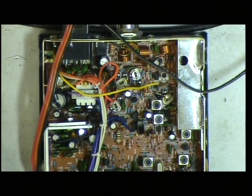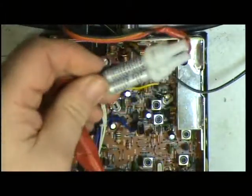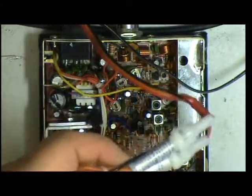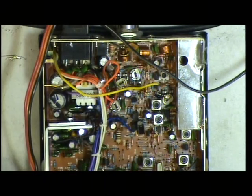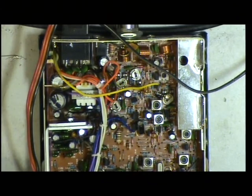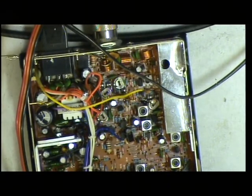The circuit diagram we've got is a photocopy of a photocopy; the block diagrams are some help, and I've been able to do up a little chart of adjustments. So we switch it on — these default to channel 9. They have a 3-wire power lead: two positives and a negative, so you can have a constant power for the memory backup. On channel 20, we're going to transmit, and of course it should be 27205. We've got no transmitter at all — that could be a deaf mic.